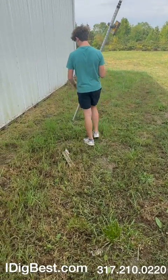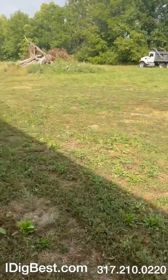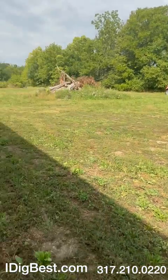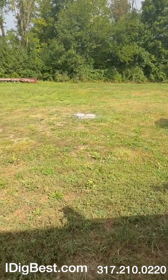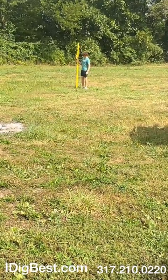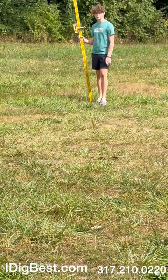Okay, so I'm going to give an example of a good way to find quick results. I've set this to 0.5 slope downward, so it'll fall. This is a farm field, so it's different. I know from this building at 0.5, how much fall we've got — there's a creek in those woods. Joey, take that and run on down that way. At a half inch in 10 feet of fall — which is minimum of all minimums — take a shot right there and show me how high or low it is to the ground. How far out is it? 6.5 inches. So we need 6.5 inches of soil there, going down towards the creek.